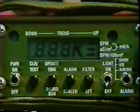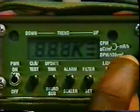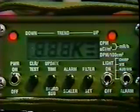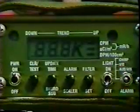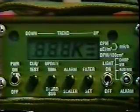During the ten seconds the segment display appears, set the alarm switch to this position. The alarm stops. Set the alarm switch to alarm. The trend lights come on. Set it to chirp. The lights go out and the alarm sounds. Returning the alarm switch to this position silences the alarm and ends the alarm test.